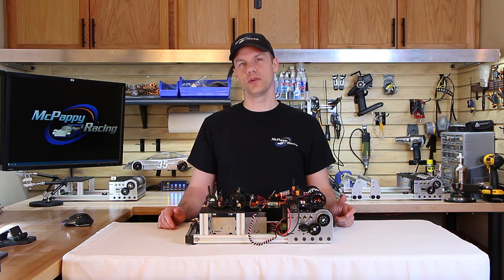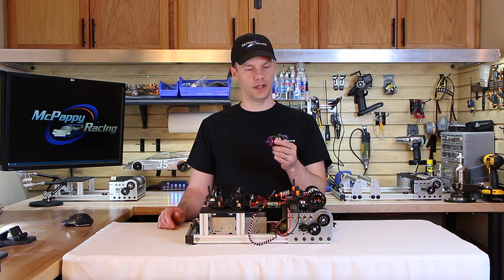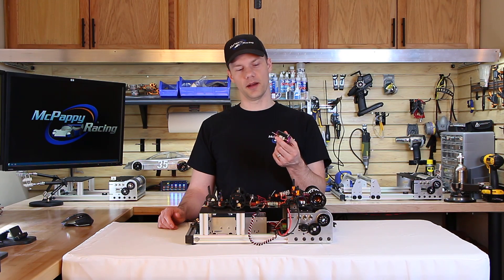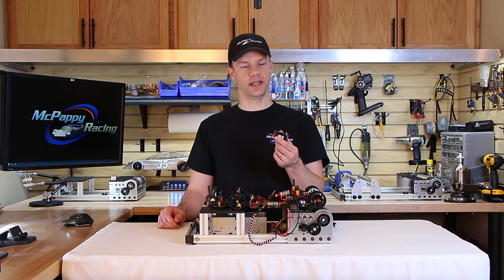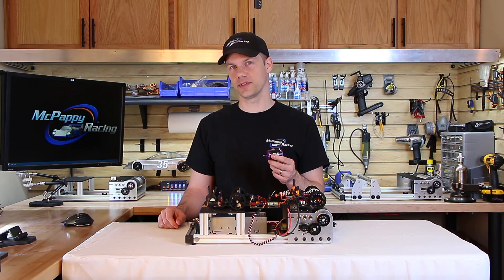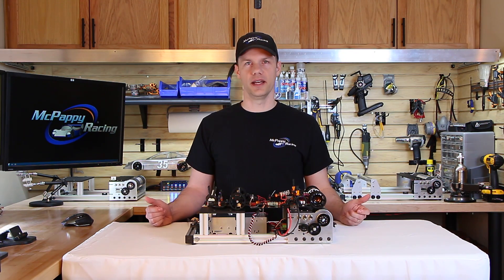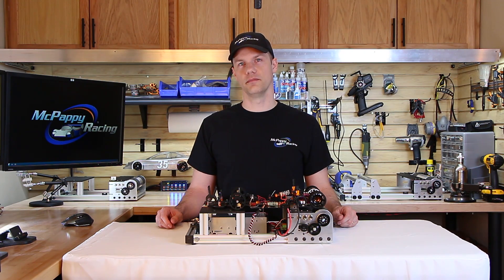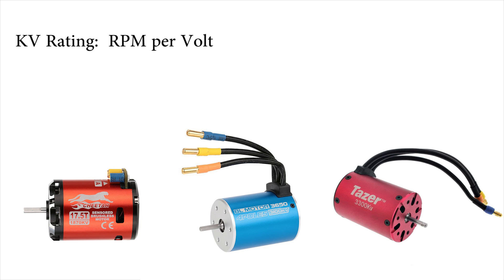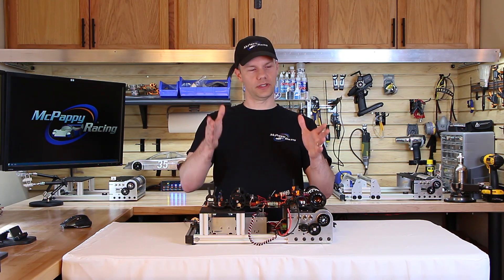Without load, you can make most motors look better. For example, I could apply some voltage to this motor here to free spin it, then replace the rotor with a smaller diameter rotor and the RPMs go up — but did I just make this motor more powerful? Likewise, I could replace it with a lower gauss rating rotor and the RPMs will usually go up again. I can mechanically turn up the timing and increase the RPMs by 25% — but did I just make this motor 25% more powerful? No, it needs to be tested with a load to find out if the power actually changed. As for KV ratings, these are typically associated with sensorless motors. KV means RPMs per volt but what you'll rarely hear is that this is at no-load level. KV ratings are not useful in determining how much power a motor has — it was meant to be a basic guideline within the same manufacturer line to compare motors.